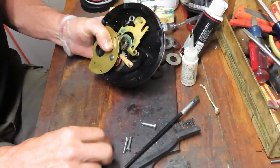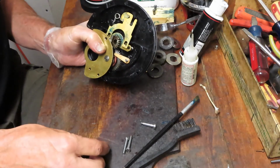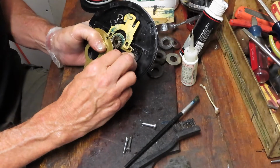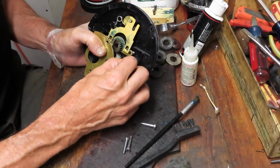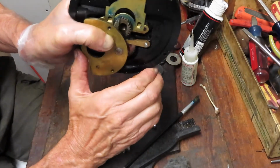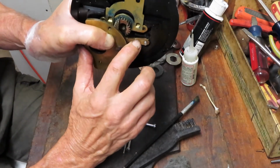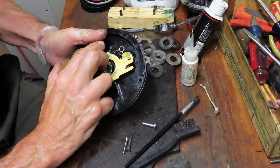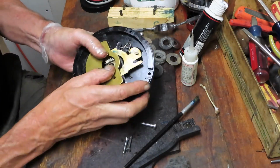there. Next up then is the flat spring that rides over the top of the dog, rides behind the stud, and rests on this side plate. So we'll see if we can do that up close. It's riding on top of the dog, under the stud, on the side plate. And then you can complete the rotation of the bridge.